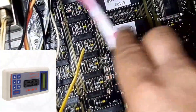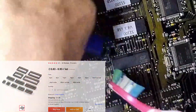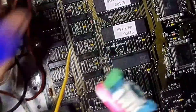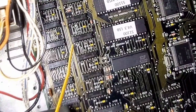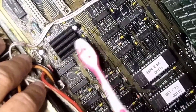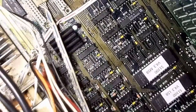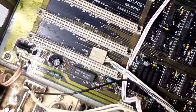I bought a RAM tester, which probably won't arrive for a few weeks, and I bought some DIP sockets so we can start taking out these chips and testing them one by one. There's another section over here — I need to set this microscope up and take the board out. I believe these chips here are RAM as well. We've also got an old TDK chip down here.